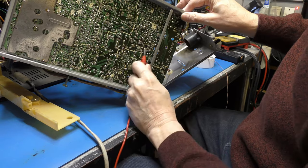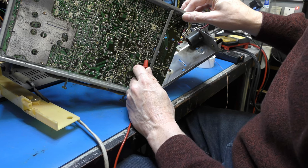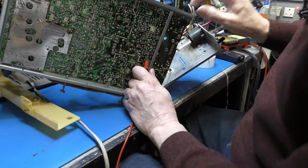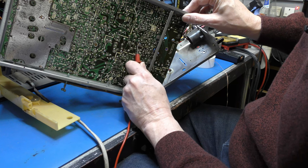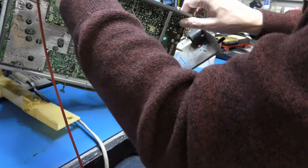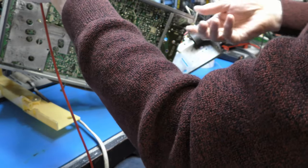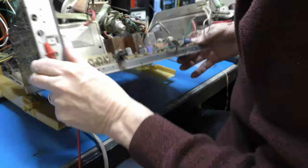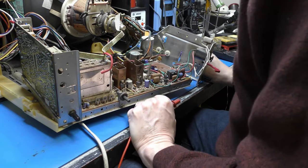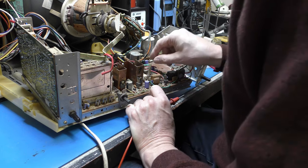So it's that resistor that is going between, let me get this right, it's just above TP9 in the middle of that cutout. So it's that one there. And oh, it feeds a lead, which doesn't help. That goes off to N. So let's just find out where that's ending up. It's R564. Feeds a lead which goes to N, which goes to pin 8. Now that's a worry, because pin 8 is sort of our EHT earthy end.